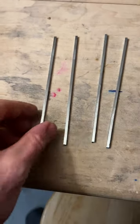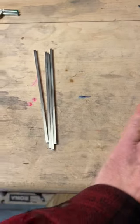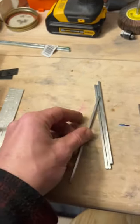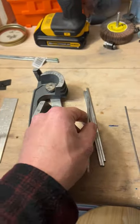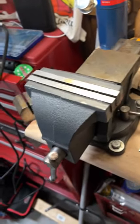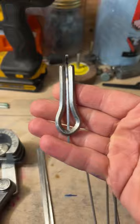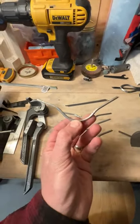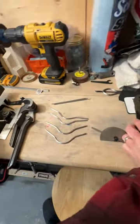I've got four lengths of 1/8th keystock. I took all the galvanizing coating off, so they've all been cleaned up and are ready for their initial bends. Here are the reeds. This style of harp — all mine so far have been pretty much just hand bending around things like sockets. I'm going to start by bending the arms to a certain angle, then wrap the middle around something in the vise, like a socket, and hope for the best. This is about as far as I can get with the tube bender — a good chunk of the frames started, fairly consistently nice and straight. The rest will be by hand in the vise with a pair of pliers.